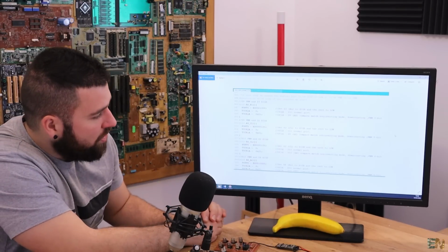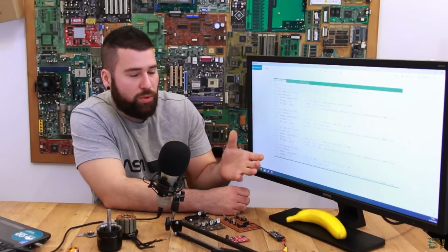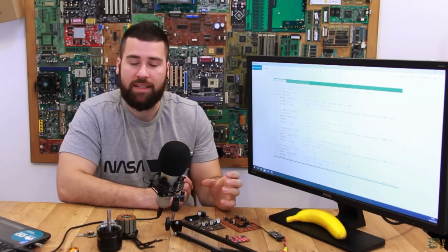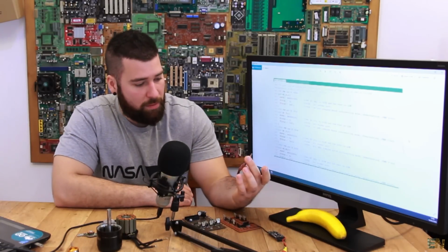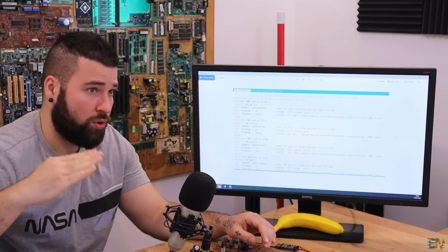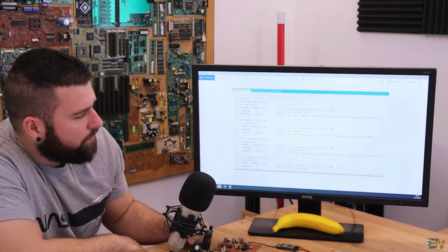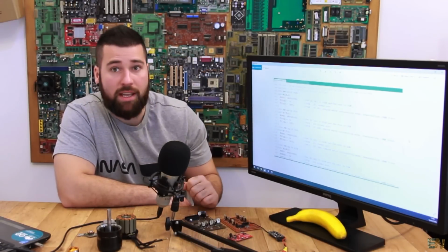We'll have 6 of these voids. So read this in the code in order to understand more, but all we are doing is changing the port output to be high or low and create those signals for the sequence of the 6 steps. And not just that, but we apply a steady signal to one of the MOSFETs and the other one, which is connected on the bottom side of the bridge or on the top side, I don't remember right now. One is a steady DC voltage and the other one is a PWM signal in order to control also the current that is passing through the coil. So we energize it and then we de-energize it. That's why we use the TCCR1, which is the timer register for the PWM signal. So we change it to enable or disable this PWM signal.